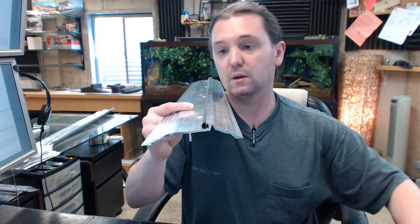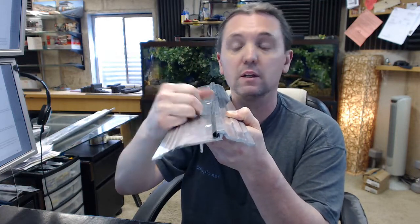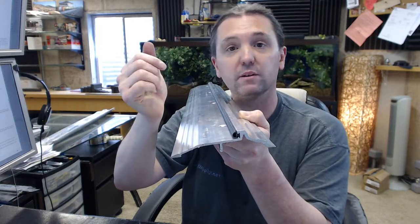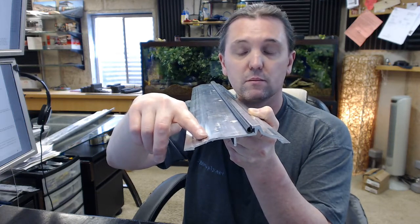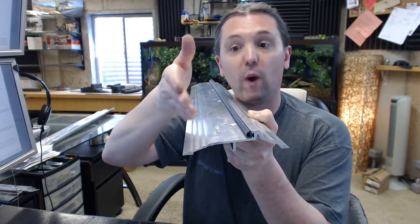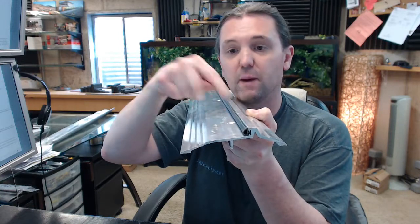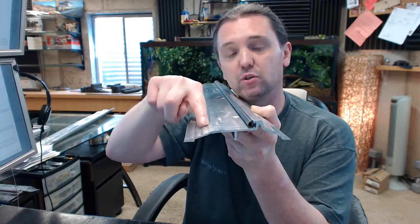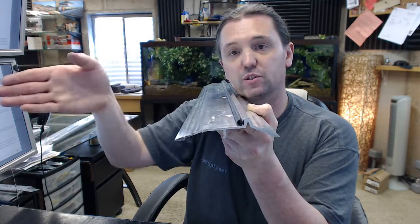Okay. Now, bump up, well, you get that idea why it's called that. And I like these a lot because they give such a positive seal against the face of the door. You know that when the door is closed, you've got a seal. You could even wear belts and suspenders. You can put a door sweep out here if you like. And I like that idea a lot because let's stop the weather at the outside of the door rather than on the underside of the door. That's my logic. So adding a door sweep out here, I like to do a lot. Okay, I want that barrier to be outside here. Obviously, that door swinging out.